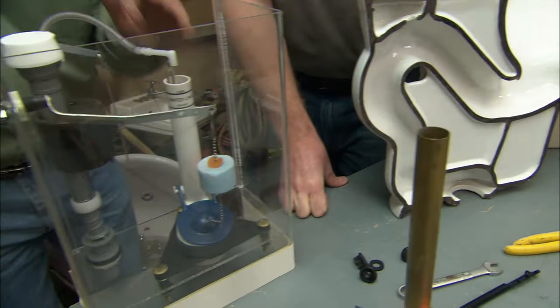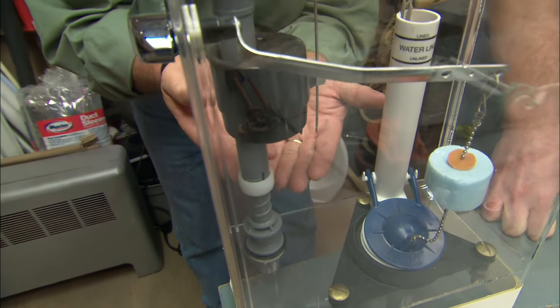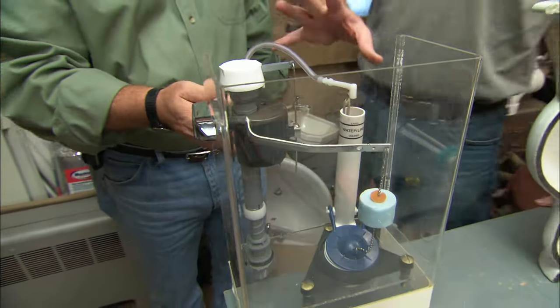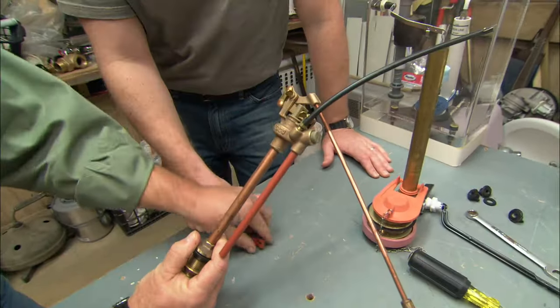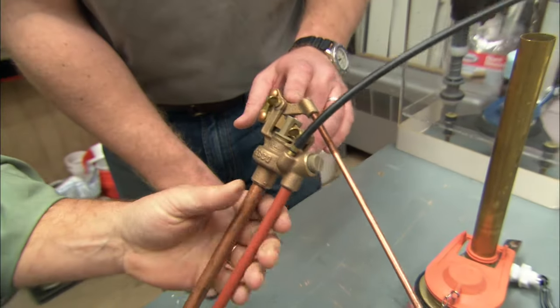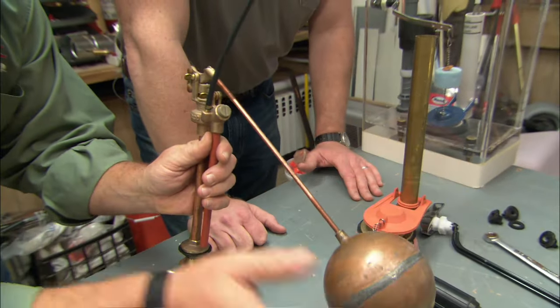Once that's finished and the flapper closes, we now have to refill the tank. This is the fill valve right here — water will continue to rise into the tank until it lifts this float and shuts it off. This is really one of the first water regulators I would have worked on. Cold water came in through here; it's a brass unit with a piston that would open and close to let the water in. The way it was activated was by the float — a copper float. As the water rose, it would lift that float and ultimately shut that piston off.